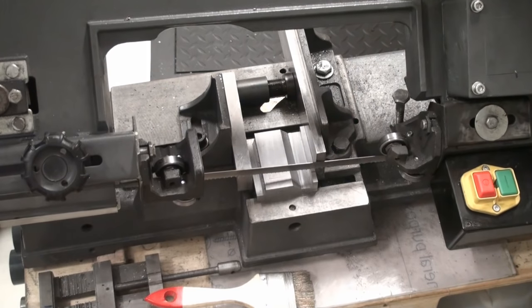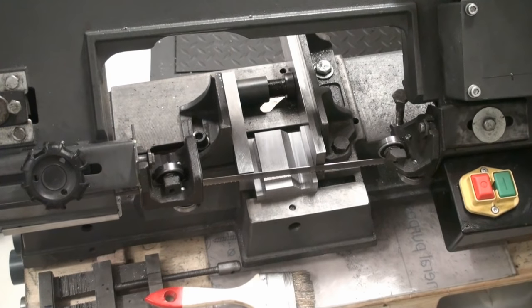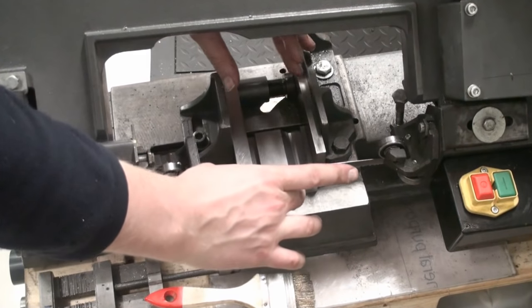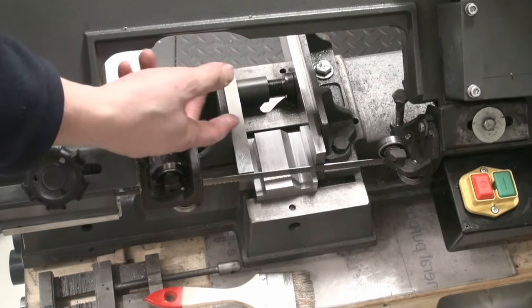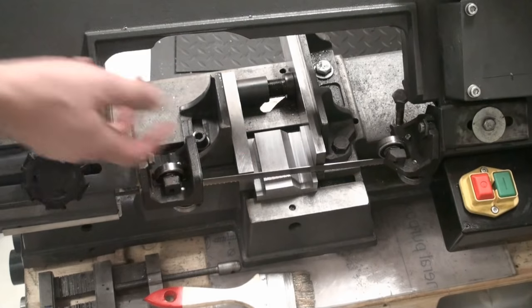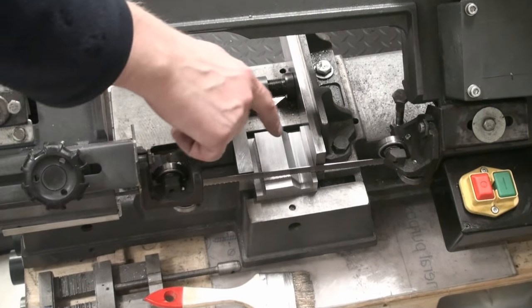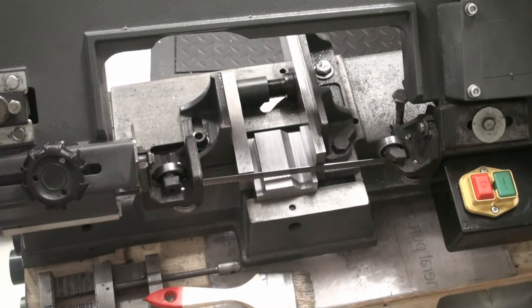It would be nice to have such a nice small bandsaw pallet as Outside Screwball Chuck showed. He had a small steel plate or aluminum plate with a fence in the back and some tapped holes where he can clamp parts for the bandsaw with strap clamps. And I will build something like this. A friend of mine just drilled and tapped a few holes into the base of his bandsaw. Also a very neat solution.